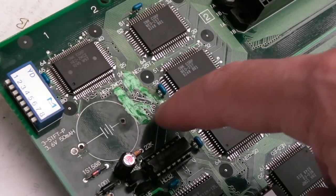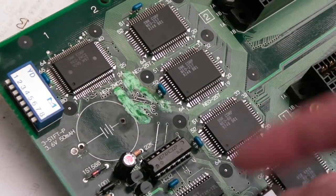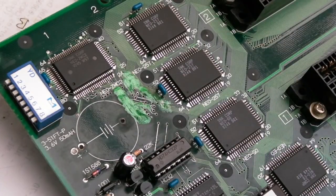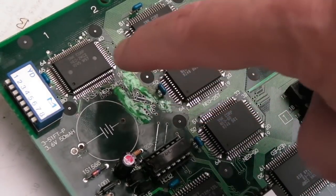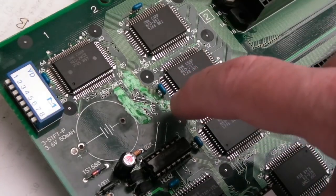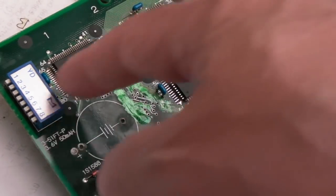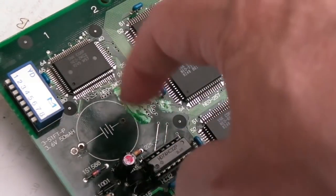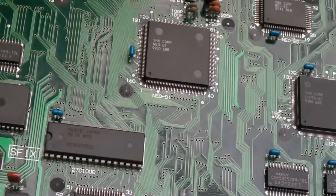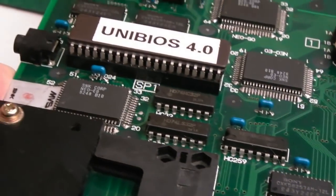Personally, I prefer to do that because that trace is fixed, that wire that comes up there, and it's a really fine wire. That's just going to protect it a little bit from touches and things, I guess, more than anything. But also, it's about covering the little bits of copper that aren't covered with the solder, where they could start to corrode. And obviously all of the wires are exposed there, so you could do connectivity tests. And obviously you'd probably have to remove the thing to be able to see where the traces go, but it's not a permanent thing. But as I've said so many times before, it will be permanent as long as you want it to be permanent.